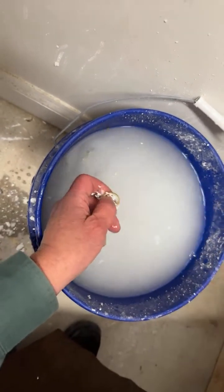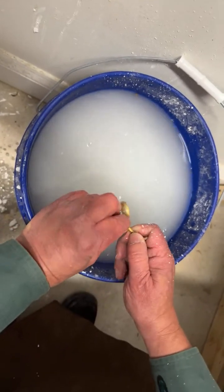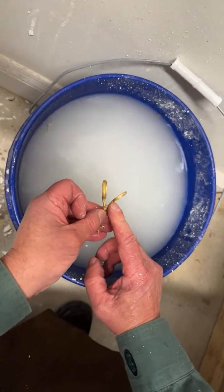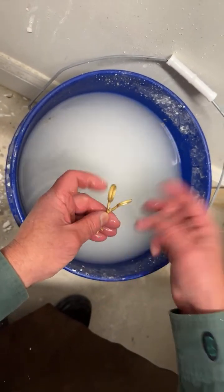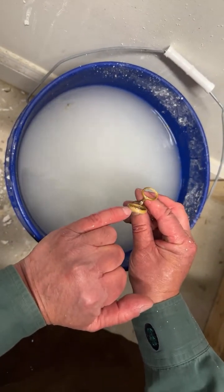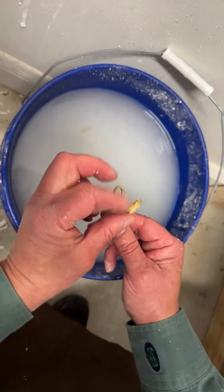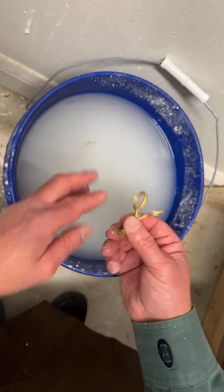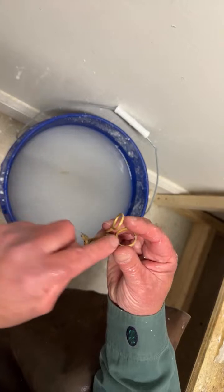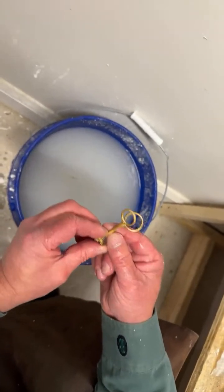And we'll drop the flask and I'll clean it out later. So we're going to get this plaster off. And then what we'll do is we're going to cut the wedding bands here and then file it, sand it, polish it, and they'll be all done. A little bit of flashing from the investment, but that's something that I'll just polish right off. Alright, so that's where the gold shot in, made the 2 bands. So this gold is good. So we can reuse that gold again the next time we do it.